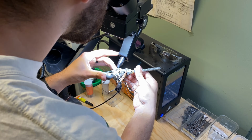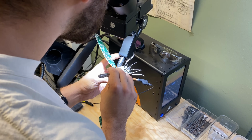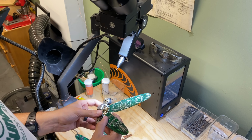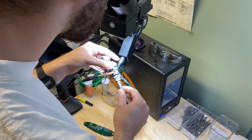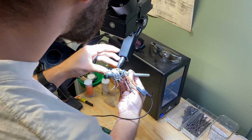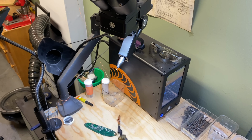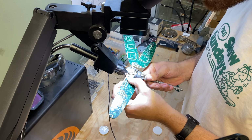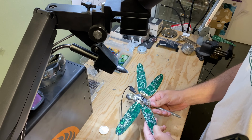This mainly involved welding from as many different angles as I could, so that when I added the second wing, it wouldn't get in the way and prevent me from doing any of the key welding I needed to do. Once that was done, I added the second wing. Repeating this on the second side is always harder because this time I've got to match something exactly, instead of getting a vague angle correct.